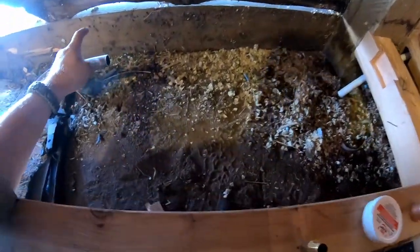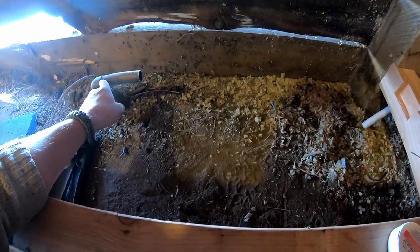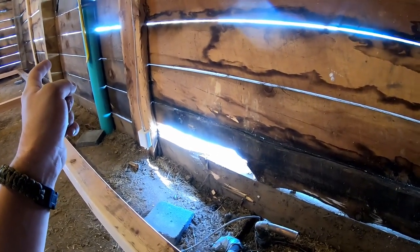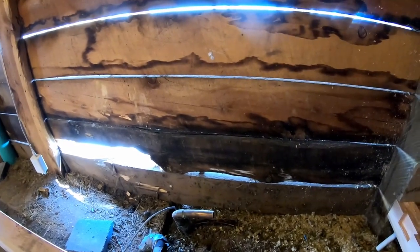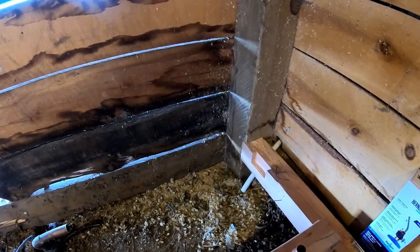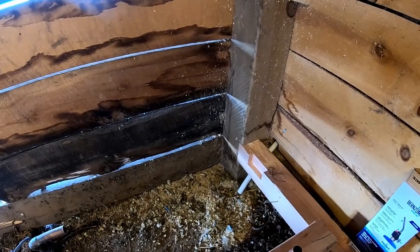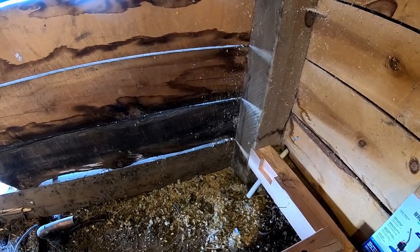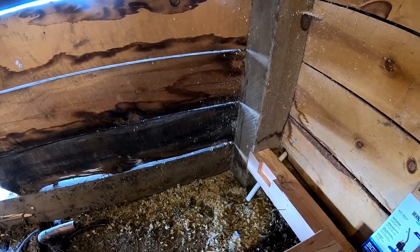Before we put in this last girder member, we've got to resolve the plumbing situation. There was a copper pipe that went pretty much right through where that girder is. We're going to be adding a sink to the shop area that'll hook into that drain, so we'll want to plumb some hot and cold water out to the sink. Behind this wall there's a water heater that feeds a loft apartment above this barn, and the easiest thing to do is replumb that whole situation with PEX — partly because it's more freeze resistant and also to add a mid-span run out to the sink.